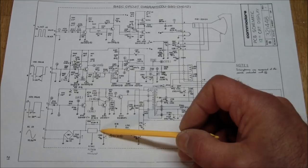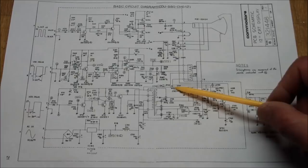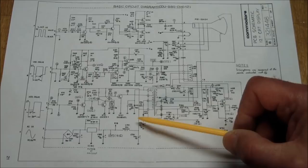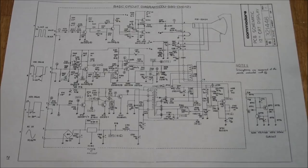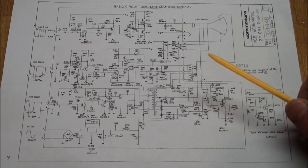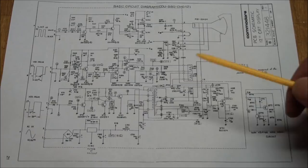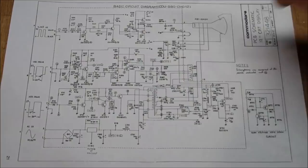But then I started testing waveforms, comparing them to what was given in the waveform charts and voltages as listed on the schematic. And pretty much the 18 volts main supply is the only thing I get that's working. Everything else is pretty much non-functional. I embarked upon a long test of the circuit. I pulled out the chassis and I started to test components. Obviously, first transistors, diodes. I tried to check continuity in the flyback. I did check continuity. It seemed okay. All the transistors checked good. Checked the capacitors, they were good.